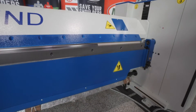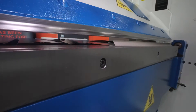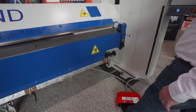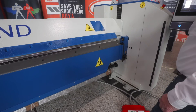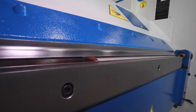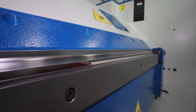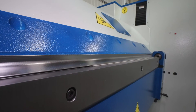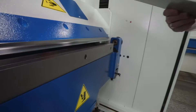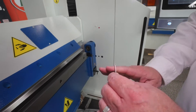We've now made a nice sharp bend. The beam will lift up, and now I'm going to push the material back in because it's going to come down and crush our piece. We go back to the first step, and you'll notice it stops at three-eighths of an inch — this is a safety precaution so no fingers are crushed in the process. Now we go ahead and put our hem down. And there you have a nice flat hem — no gaps whatsoever, nice and flat with a tiny teardrop creating a nice smooth edge.